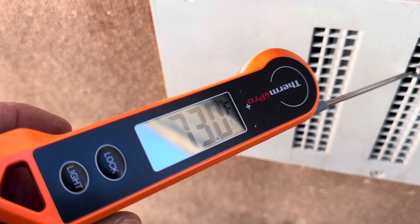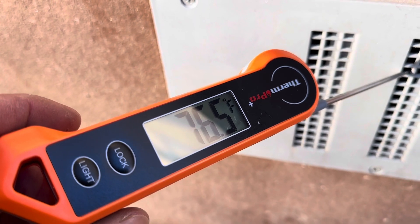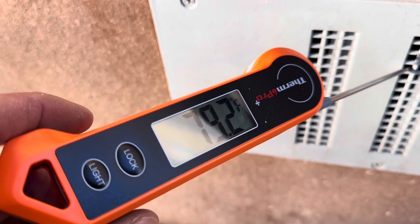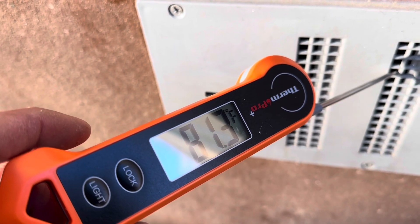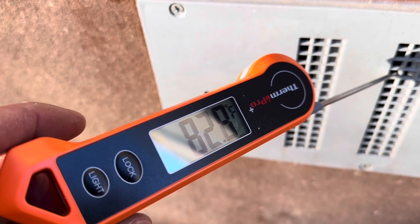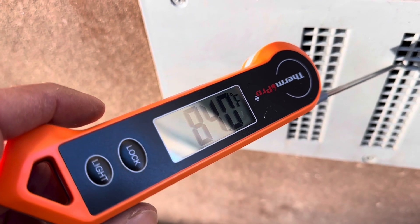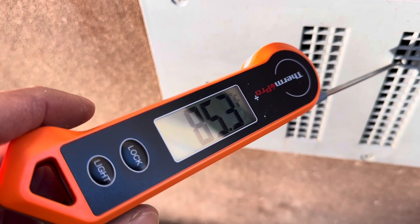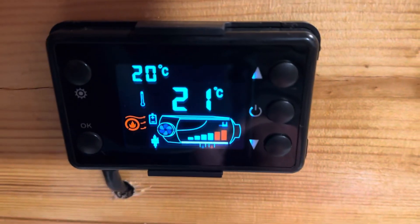It's only been on about 10 minutes and it's 50 degrees outside — look at that, the crawl space is nice and toasty. I'm going to try to keep it around 85 degrees or so under there. It's like a radiant heat setup, and it's drying it out too — the RH has dropped in the house since I started. We're at 83-84 degrees underneath. I don't want it too hot, but once the floors heat-soak and that thermal mass loads up, it'll be nice.